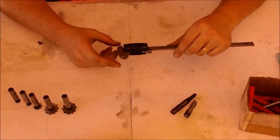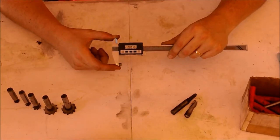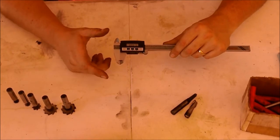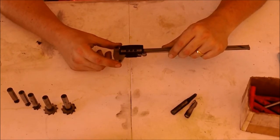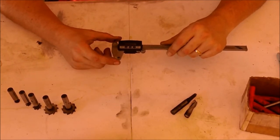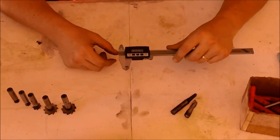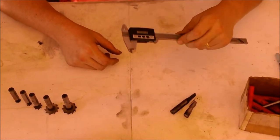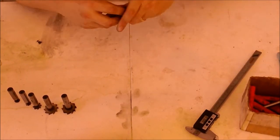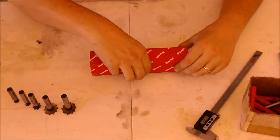And I've used these things, and I've checked the diameter with these, and then used the micrometer, and it's within 1/1000th every time. Last time I did a side-by-side comparison, I mic'd it and then hit it with the calipers, and the 10,000ths reading was accurate on these. So I love Starrett. I don't get a whole lot of Starrett stuff because I don't have the money to do it right now, trying to get the business up and running.